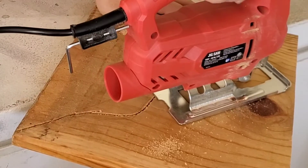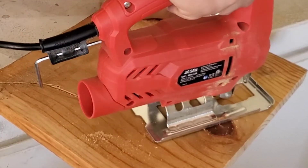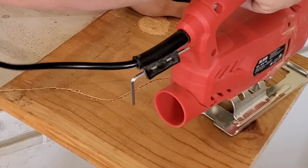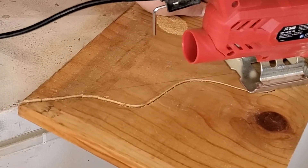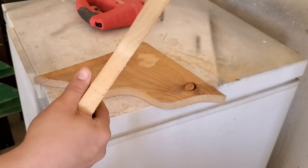And for two I can do a lot of versatile things, like cut this corbel shape out. I am using the speed of five and I am also using a wood blade. Those are easy to snap in and snap out, and you can really get the shape you like with this jigsaw.